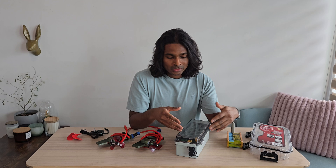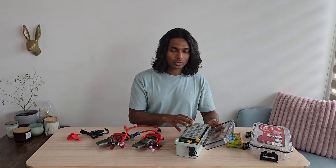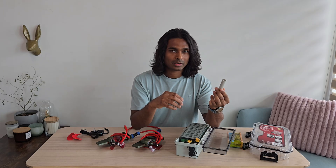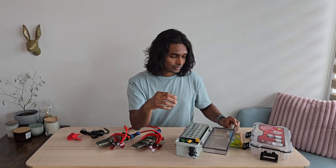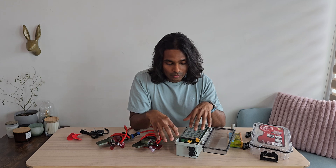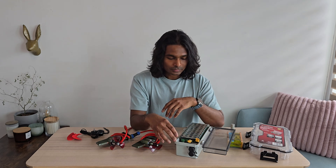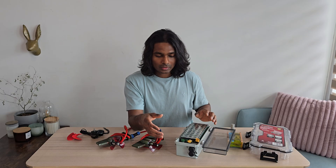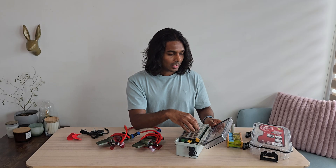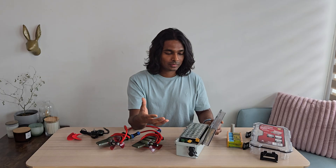Other improvements would be inside this battery box. This homemade battery runs good — it's good enough for the old motors — but it doesn't have enough current capacity for these new high-power motors, so I need to upgrade the cells. Also this battery box doesn't have enough space for the ESC, so the ESC overheats and I have no way to get the heat out of the box. Sometimes I have to open up the box so that it cools down during use. And it doesn't have a good enough seal — it is supposed to be waterproof but I could still see some water gets in sometimes if I drop it in water.